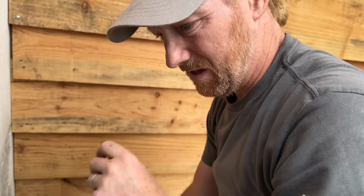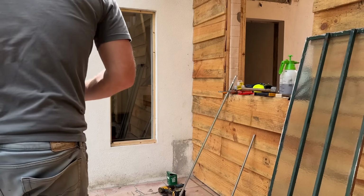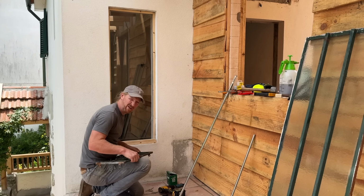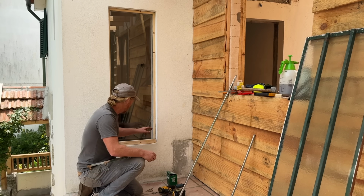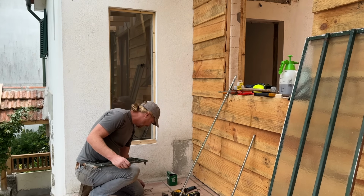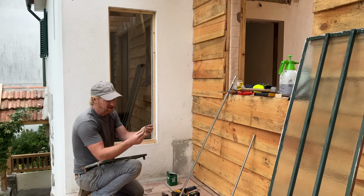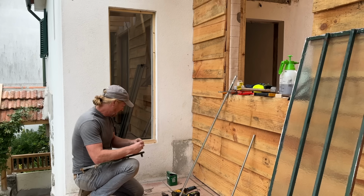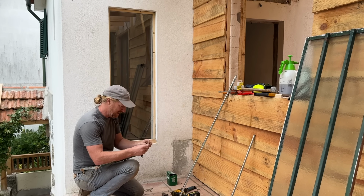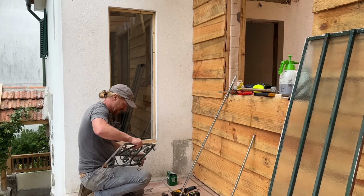With those holes, because they're breeze block holes. Okay, I've been fiddling around. I've done two things there. I've taken out the old plastic wall plugs and I've put new plastic wall plugs in. These screws here, they've got a shorter blank space at the top of them and more thread, so that means that they'll get the wall plug going quicker. I think that should really, yeah, it should solve the problem. So we'll try them.